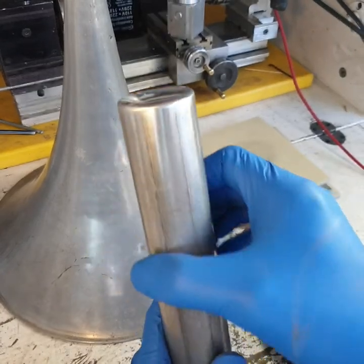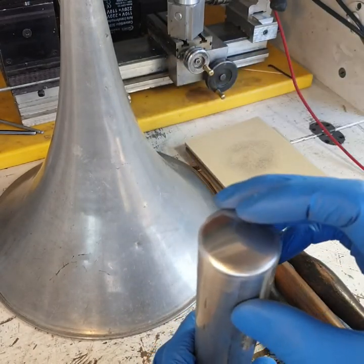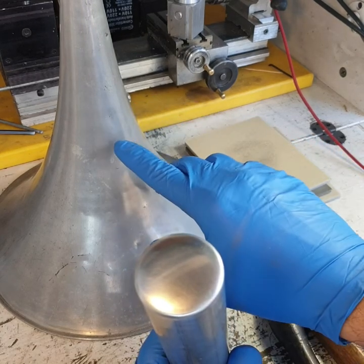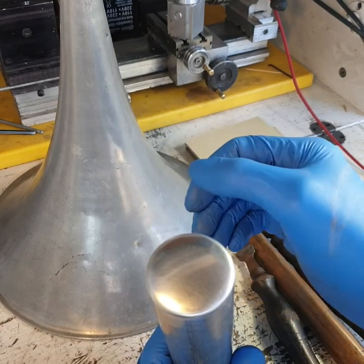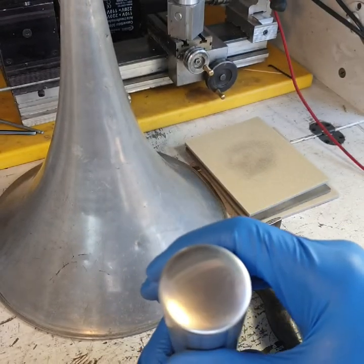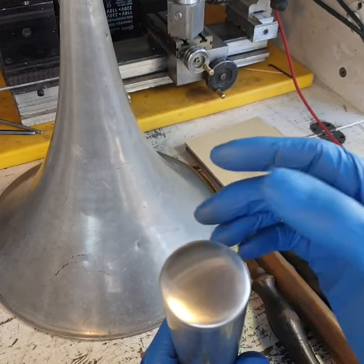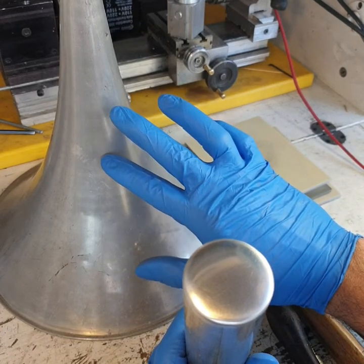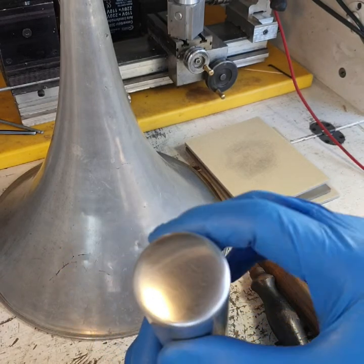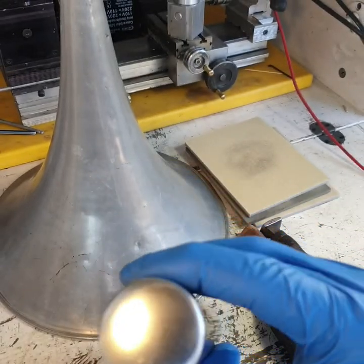And then I have a big bar of aluminium, and I use aluminium for aluminium and not steel, because as I explain later, you have to be very gentle with aluminium, because if you use a steel anvil, this sort of anvil, you apply too much force, and you stretch the aluminium too much, and you make a permanent damage. Okay, and again, this must be very, very smooth. I have to sand it every time I start working on a new horn. I sand it until it's smooth. Okay.